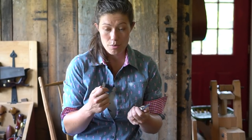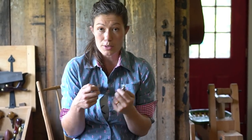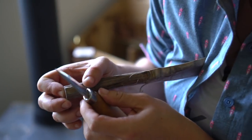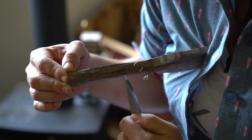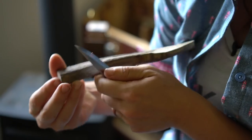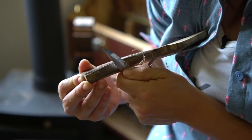With the pull cut, I'm going to balance the wood up against my body with the knife pointing towards myself. My elbows are tucked into my body. You want to think about where your other hand is too — make sure the piece of wood is there just like it was with the axe when we're chopping, to stop the knife from going into your flesh. I'm carving very close to what's called the hilt of the knife right here, because if I was carving out here there is actually danger of it slipping and cutting my arm, but as long as I'm right here I'm perfectly safe to cut towards myself. You can get especially nice perfect cuts when cutting on a long stemmed spoon.